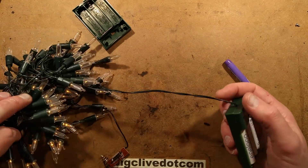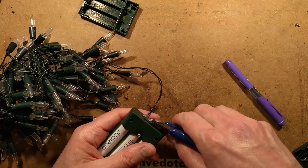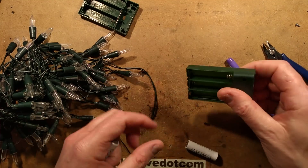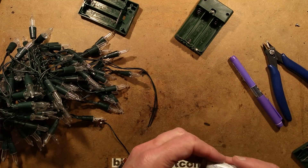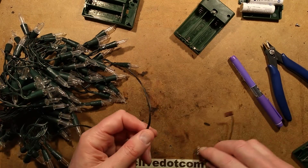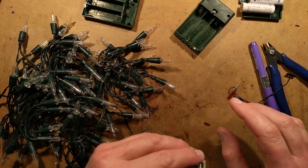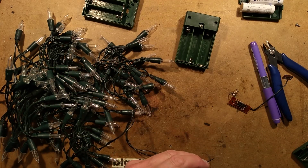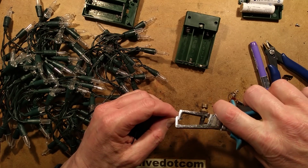Some of you have asked how to convert these to run off a USB supply instead of a battery. The way you do that is turn the power off, take a pair of snips, and lop the leads off. It's worth noting the microcontroller is powered all the time from the batteries regardless of switch position, so it may draw a small quiescent current - probably negligible compared to normal operational current. The 120 LEDs run on about 50 milliamps total, which I confirmed by putting my bench supply on instead of batteries - so that's roughly half a milliamp per LED.